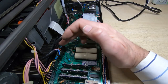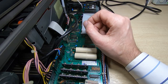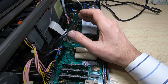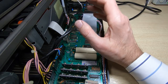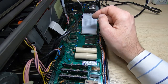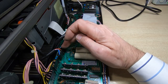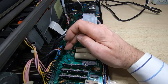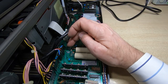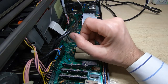When I wiggle this connector we get a change in the tone, and when the tone goes away the power consumption goes up quite significantly - from about 20 milliamps up to about 0.4 amps. Something obviously significant is changing, and it does indicate we're not getting proper contact through this connector. I'm going to take this off and give it a quick clean. We might need to change the connector on the board - it may have eaten away all the plating - but for now I'll try cleaning it and see if we can get it to do something different.